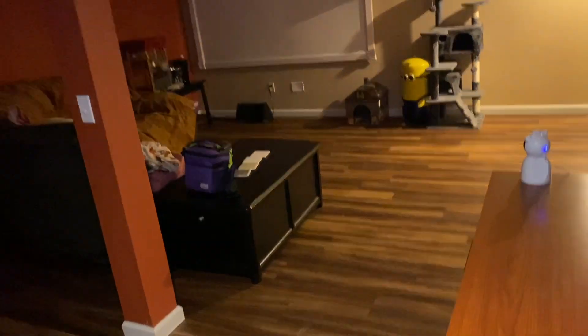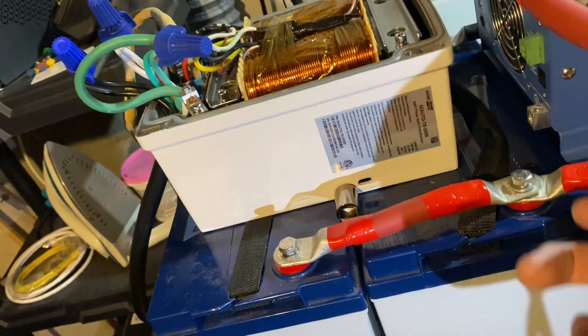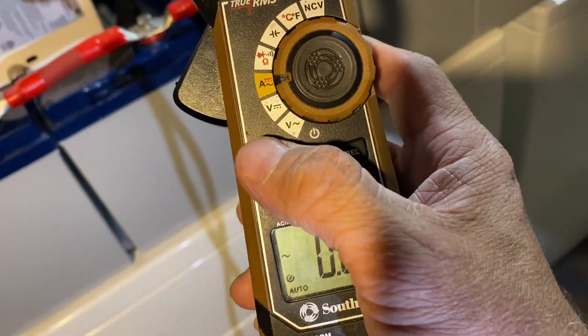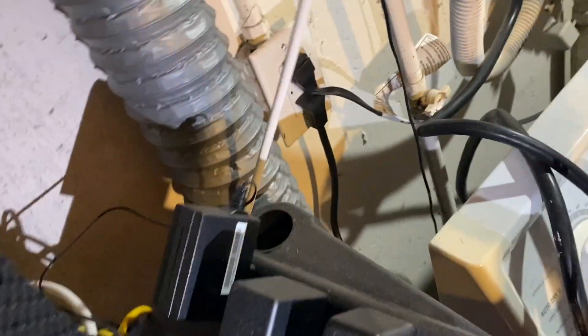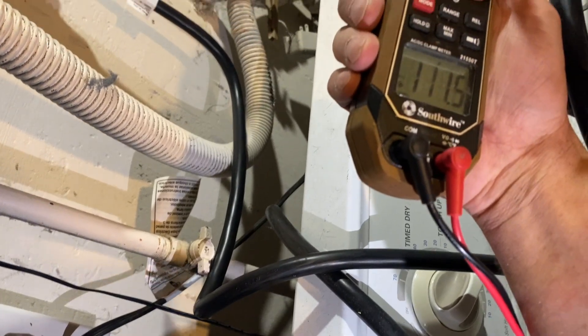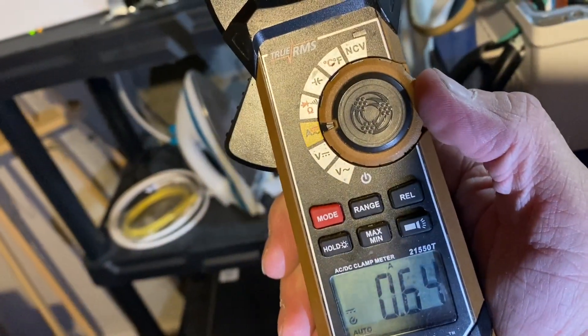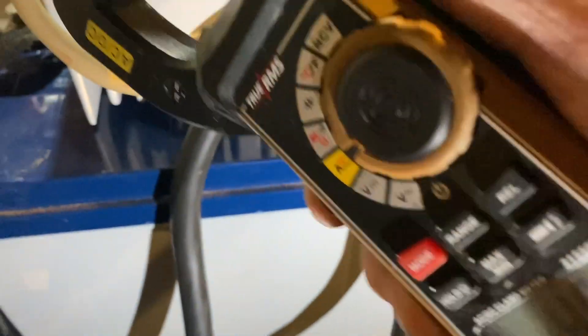Power's back on! Here we are — full power, we are running on battery. Let's see how much current we're pulling. We want to be careful because that's live, so let's not stick our hands in that. We're going to put the clamp meter on this and set it to DC to see how much we're pulling. We are pulling 111 amps DC. Let's see what we're pulling on AC — it's a tight squeeze in the corner here — we're only pulling 5 amps AC, which is about right because I don't have any heavy loads on.